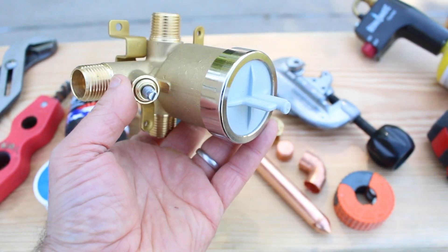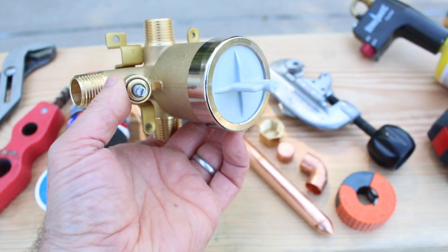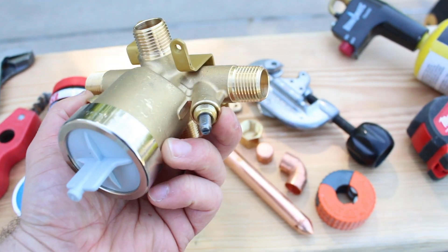A common question is: can I use the multi-choice for a bathtub or a shower? The answer is yes — you can use this for both. The main thing to know, number one, is that all shower stud walls should be 16 inches on center for most backer boards — cement board, KERDI board, Go board, Hydroband board — they all require studs to be 16 inches on center. That's really the first thing we check before installing any type of rough-in valve.